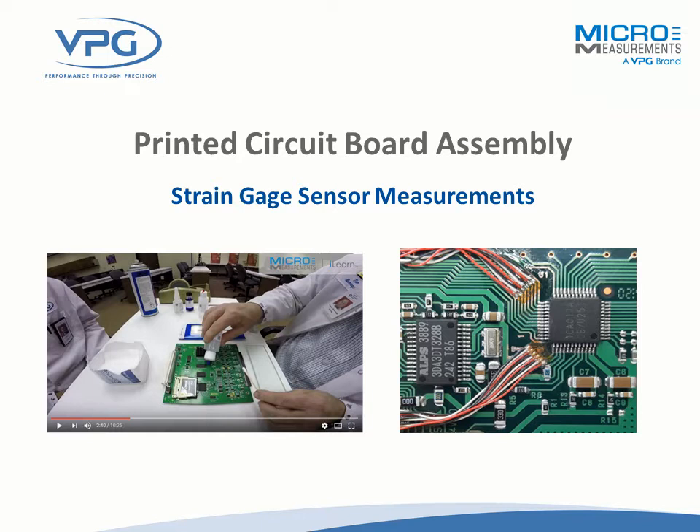This is Tom Rummage. One of the driving forces is the advent of surface mount components. With surface mount components, the stresses of bending the board and installing or dropping it go up on those surface mount components. Strain gauges have been applied next to or on those components to determine how the operations of making the board and inserting it into the piece of equipment affect the ball grid arrays, capacitors, and resistors on those circuit boards. I've been working with strain gauges nigh on to 42 years — I'm the old guy here.